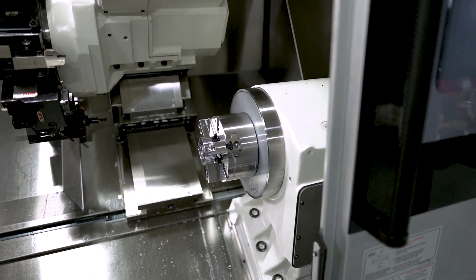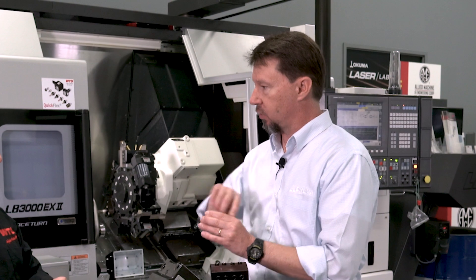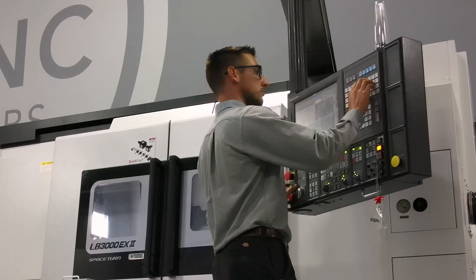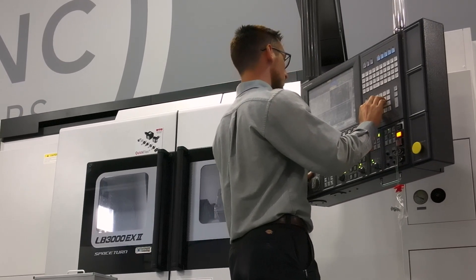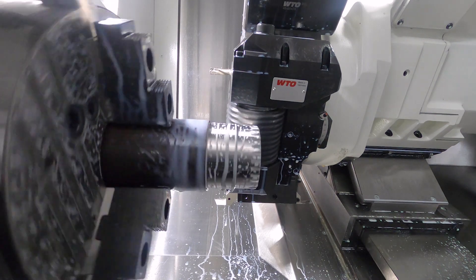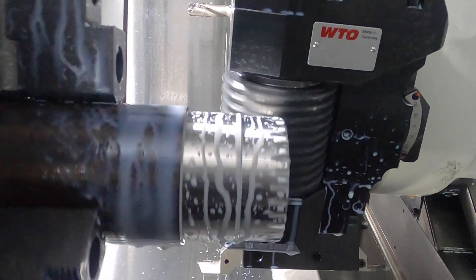What are the limitations? I'm assuming part diameter, the swing capacity of the machine, as well as swing capacity of the turret. On our mid-size unit we go up to module three. On the larger unit we go up to module six. And you've got to make sure there's enough room on the turret to actually swing it around — on our large unit it's pretty darn big.